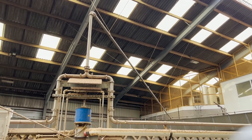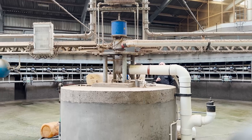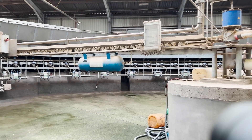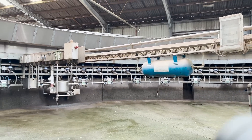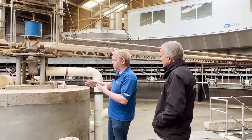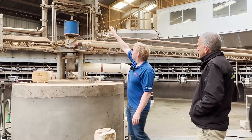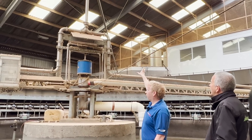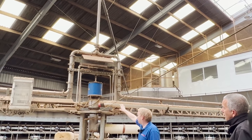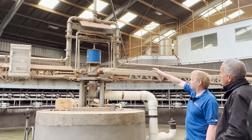The central gland is a key component of any rotary. What we do differently is our central gland is modular — it's not one gland that does everything for vacuum, electrical, and milk. This makes it very easy if you have to change a seal; you don't have to split the whole gland and it keeps cost down dramatically. The top one is the milk swivel on two-and-a-half inch lines, the center is the electrical swivel, and the bottom is the vacuum swivel.